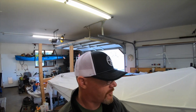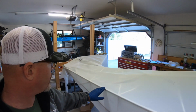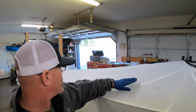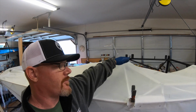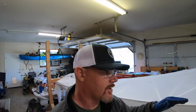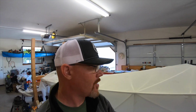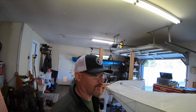So here's my tip on that. Lay it over so you have plenty over the edge, and glue down just the seam, just right where it touches the bar. Let that dry. Make sure you have as wrinkle-free a layout of the fabric as you can. Then go in and mark your line and cut it, like I've done here, nice consistent edge the whole length, after it's been glued in place, so you don't end up with the line not following the curvature.